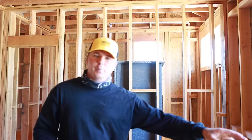I've been to a lot of houses that have Huberwood installed, the zip system sheathing, the Advantech, the whole nine yards. They're trying to build better. The problem is that a lot of them don't take that last step, rolling the tape. They feel like if they just rub it with their hand, pat it down a little bit, it's good to go. Let me show you guys the tape that I just put on this sill before and after rolling.